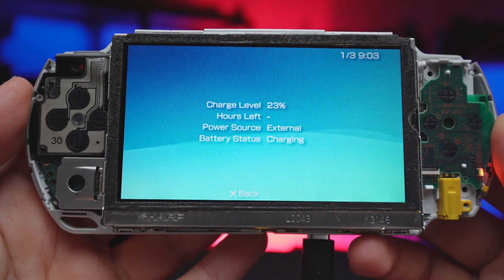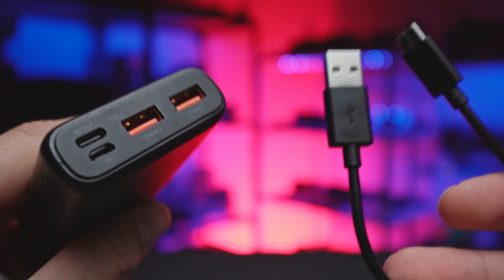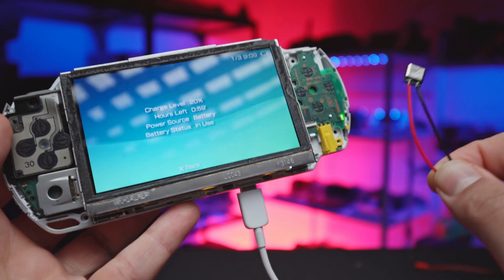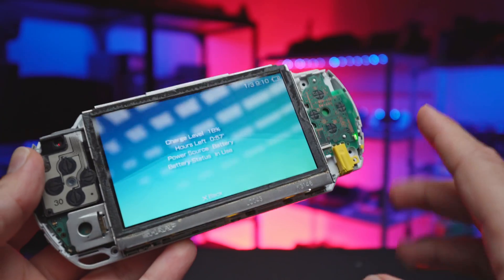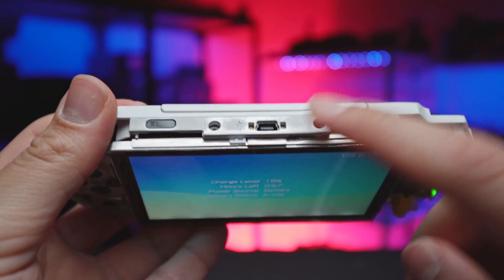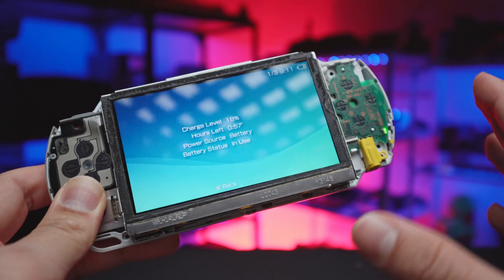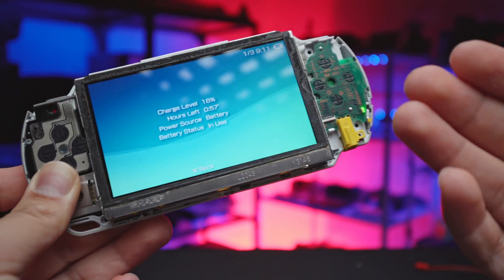Testing it out — you'll see that it's charging. Note that this port is not a smart power delivery port, meaning it will only charge through a regular USB-A port and is not compatible with PD charging ports. The reason is that this pre-soldered port does not have the necessary hardware to send a signal indicating it can only accept 5 volts. Stay tuned if you can solder, as a future video will cover a smart port supporting power delivery, regular USB, data lines, and possibly audio lines.